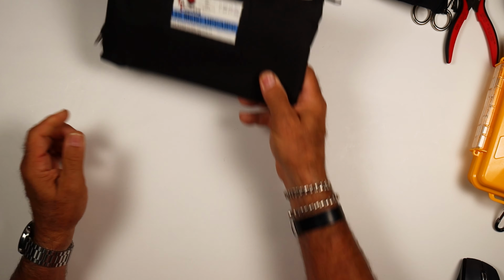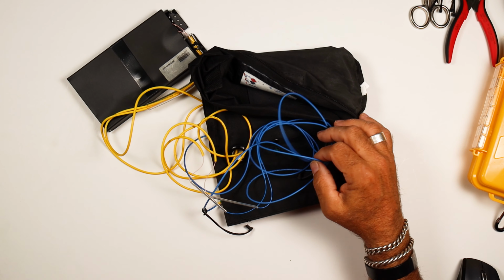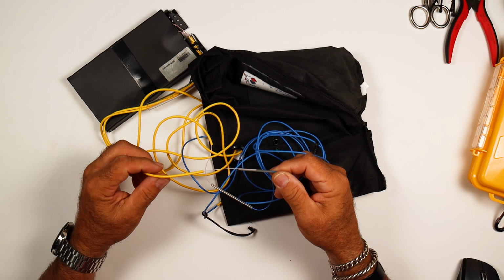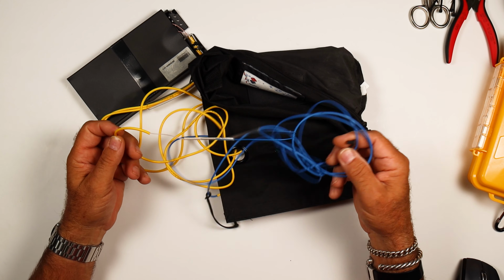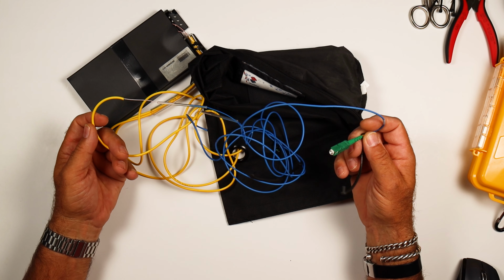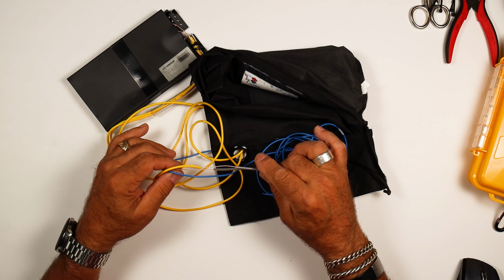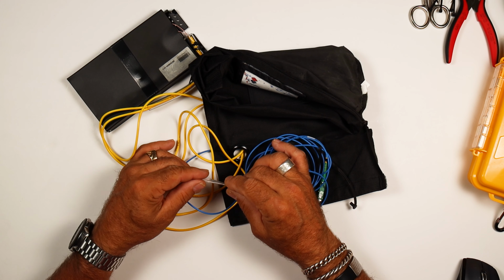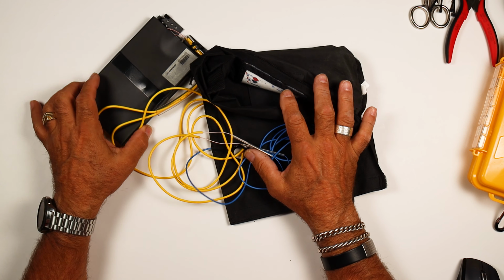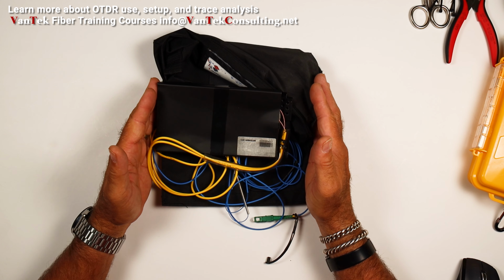The bag that's kind of in my sights right now is this guy here. He was being used during training, and somebody damaged the connectors, and so we did kind of an emergency repair, which is just spliced on a couple ends, pigtails. This is fine. These splices here, even if they were theoretically high loss splices at half a dB, they're buried inside of this bag. In other words, the loss is calculated in the bag.